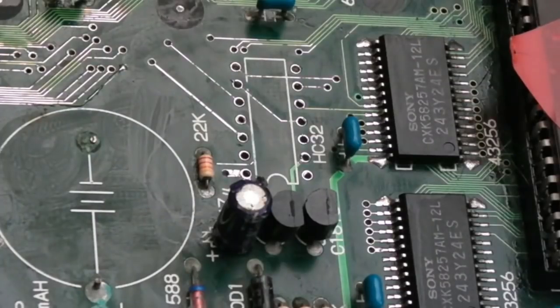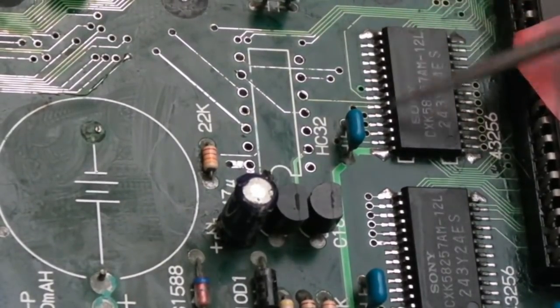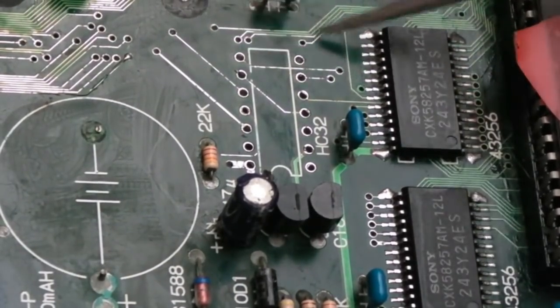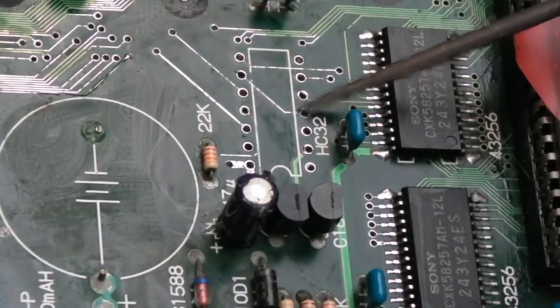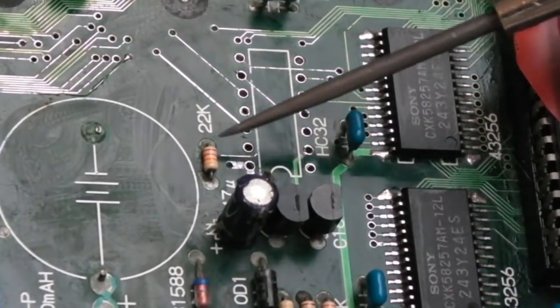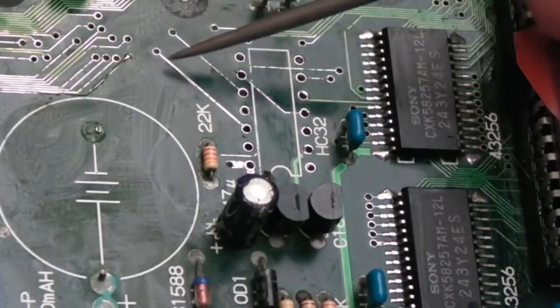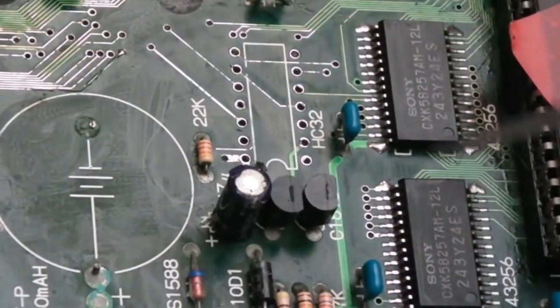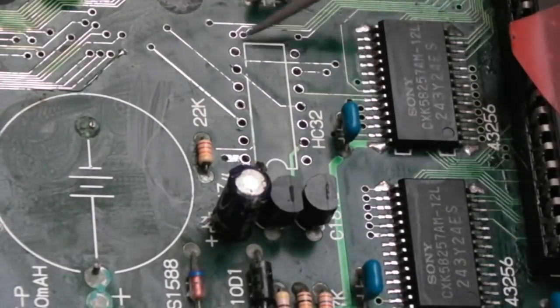So it's been more of a vlog this, because I really haven't shown much, but I've shown it on other videos before. So yeah, reflowed down here, turned up all of the wires and traces around here, measured connectivity, you know, like you've got a connection between there and there, there and there, this resistor here comes around to there, I think, and then these wires through to here, through to the other side. So everything there's okay. Obviously it needs more of a clean, but I'm going to get that socket on next.